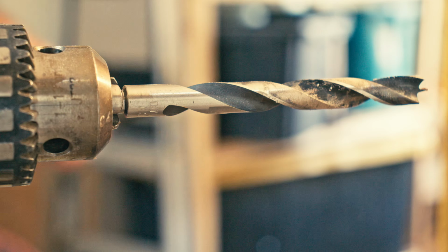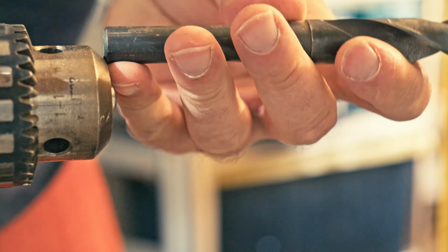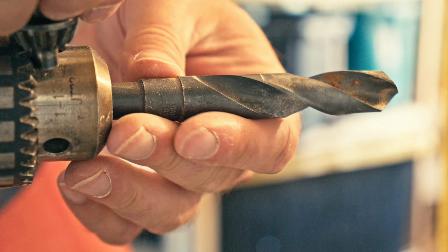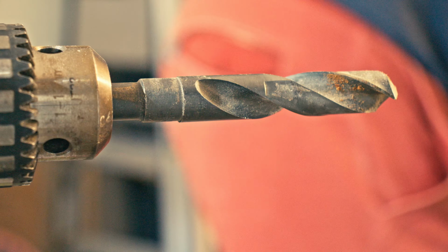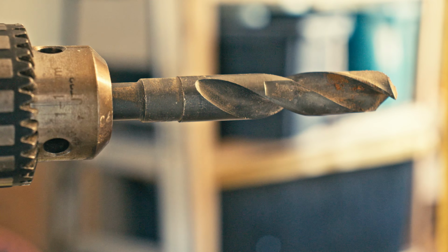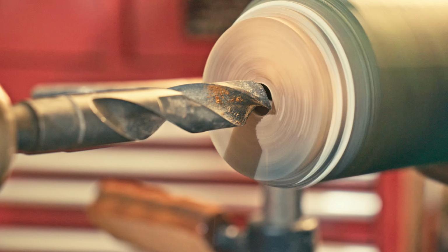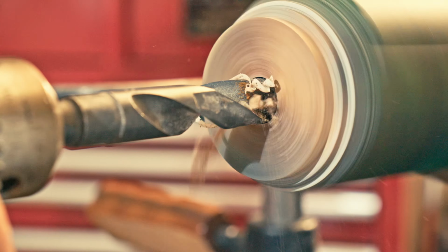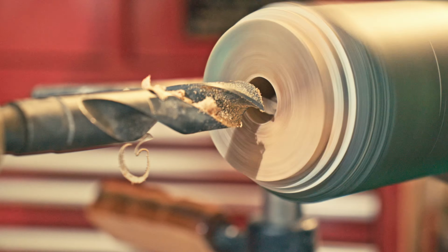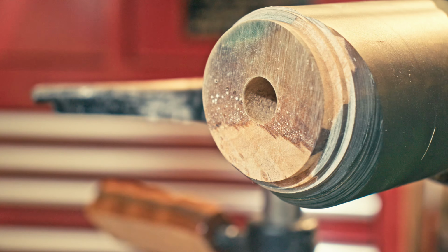And I was able to find, I'll show it later in the video, a good source for metal threadings normally designed for replacing spark plugs, but in this case I just repurposed them for mounting in shift knobs. So what I'm doing here is drilling out the pocket hole to the diameter of the outside of the threading, and then a slightly larger hole so that it has room to sort of seat itself in there without being exposed to the bottom of the knob.